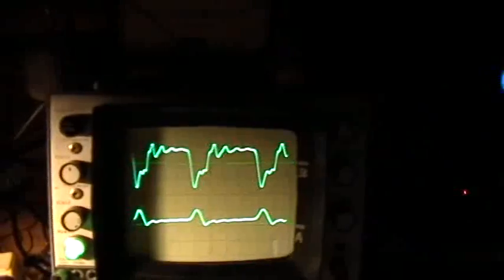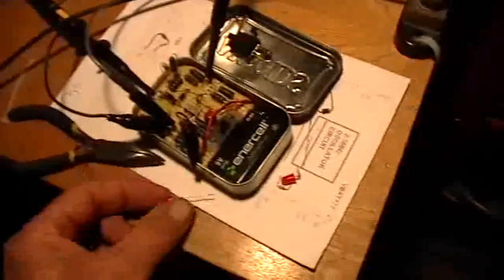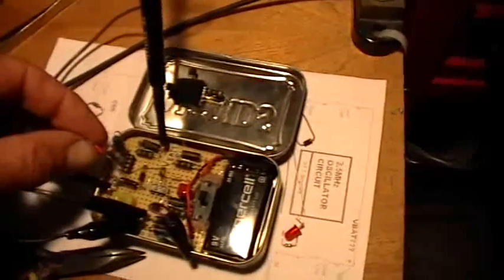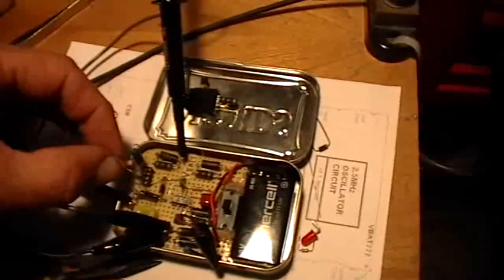And the capacitor's not in there. I just touched it briefly and took it out. So now I'm going to switch the circuit off and then turn it back on. So off, on. Alright, let's do that again. Capacitor, zener, I'm going to put it in one point right there, and then I'm going to rock it over and touch it to make the connection. There's the connection. Now I've broken the connection. Capacitor's not in there anymore. There's our 40 millivolts, which translates to 40 milliamps of current.